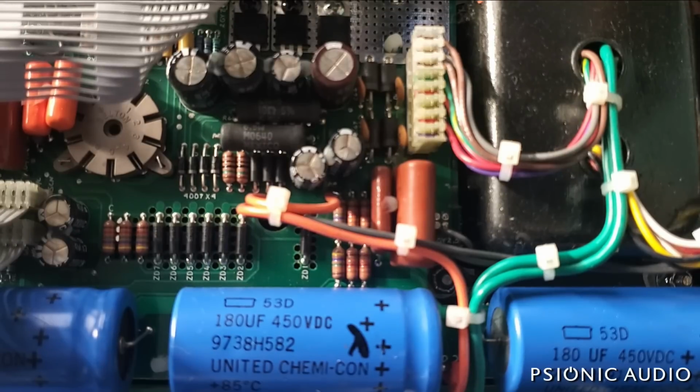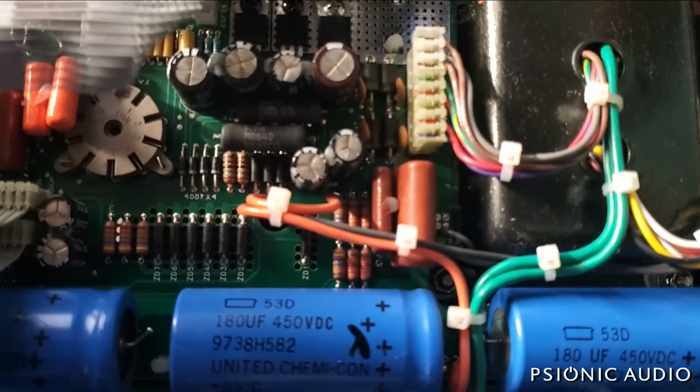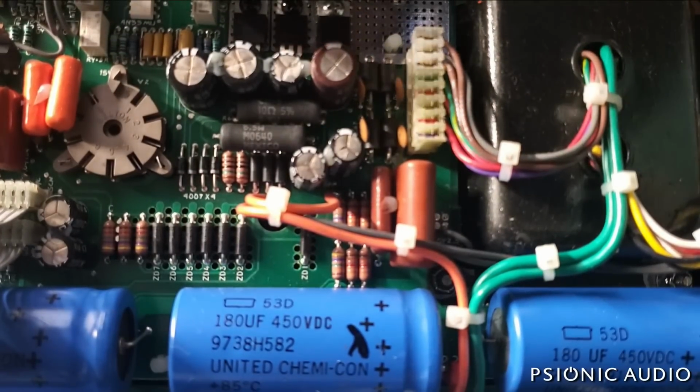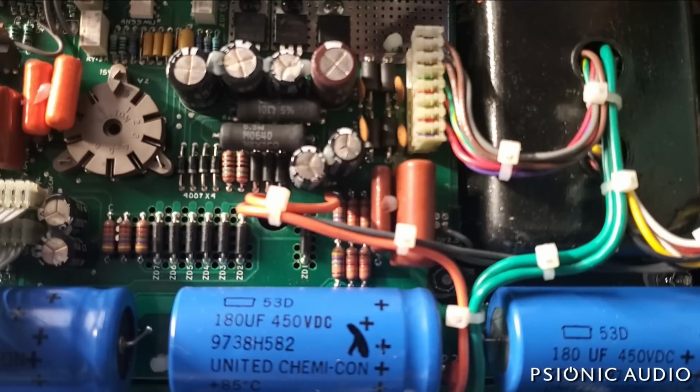Given that the noise goes away when V2B is pulled, it's also possible that we have a leakage with C42A and C42, if I can find them on here, with the 47K to ground from the grid. Sorry to be talking out loud. There's just a lot of stuff that it potentially could be on these. Let me disconnect this EQ section ribbon cable and get it out of my way, because it's hopefully not going to be necessary for troubleshooting power supply woes.